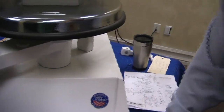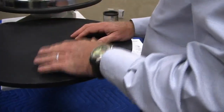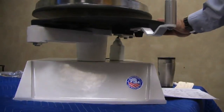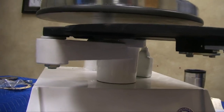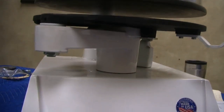Okay. The other thing, too, the lower platen, if you look down below, there's a few things we did to improve this. When this thing sits out here, it has a tendency for people to bang on it, press dough, get this thing to flex a little bit. And in the past, we'd be clanging trying to match that because it's not flat anymore. We've eliminated that by having this guy here as an assist to raise it. And there's a ramp right here. You can see how it lifts it automatically, no matter what level it is. It kind of solved the problem. And that has a little bit of tension to it, so it kind of stays the platen in place. But once it's in place, it disappears, and it's now ready to activate.